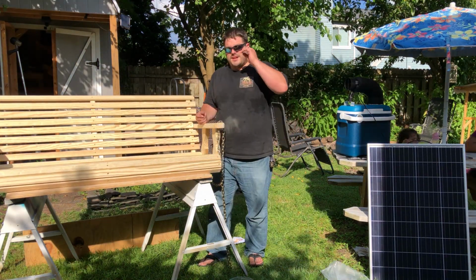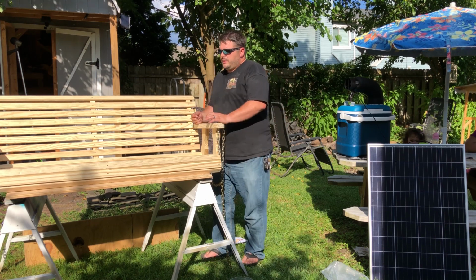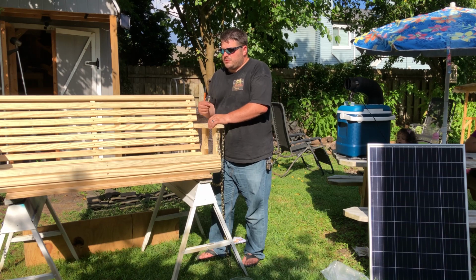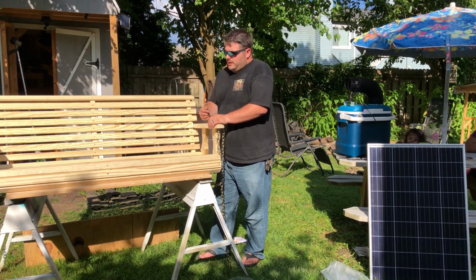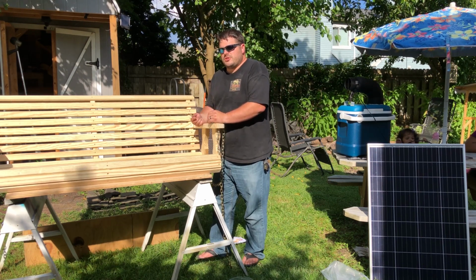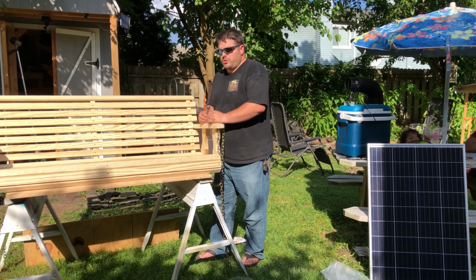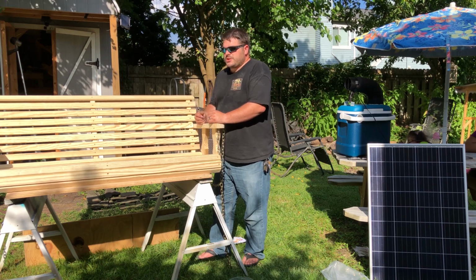So now all the bolts are tight, or all the nuts are tight, and the bolts, I guess, they go together. This really isn't a little tip. When you're tightening these up, you don't have to be Atlas on them. Once you get the head smushed in just a little bit, then that's enough tension. The wood will provide enough tension on the nuts to make sure they don't wiggle loose. That's something you might want to go through once a year and retighten those up to make sure they don't come loose, but that pretty much sticks her together.